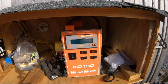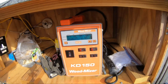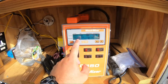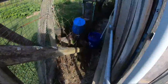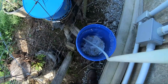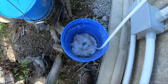Over here on the kiln, our temperature inside is 124.7. The wet bulb, which is basically the humidity, is 97.1 right there. That doesn't mean the humidity is 97% - that's just the rating you have. You can do some math to get the humidity if you want to. The compressor is running, the heater is not running. I've got this set at 120, so we're really good on the temperature right now. Back here behind the kiln, let's check the old water bucket. Plenty of water down in there, plenty more coming out. That's what you want to see when you're drying wood - it's always exciting to find water in your bucket because you know you're doing it right.